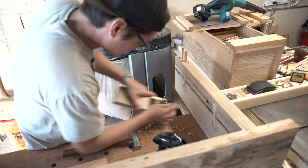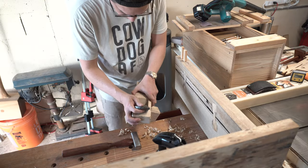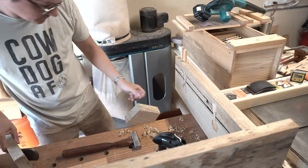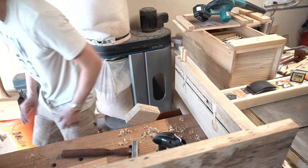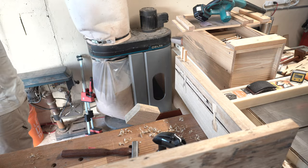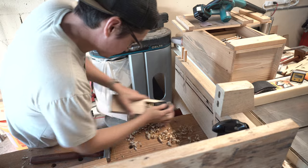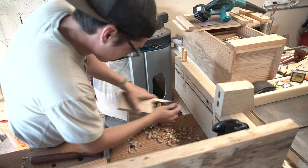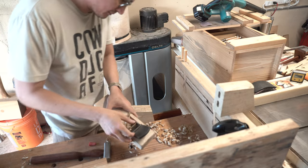This is about a 5-inch piece of material, and since the video is getting a little bit long at this point, I'm just going to use the domino to do a loose tenon joint here. I took a little time to shape them so they're not just two big stupid squares sitting perpendicular to the upright. Took a little bit to get them to match, and they're close enough considering they'll be about 69 inches apart and no one will ever really notice, to be fair.